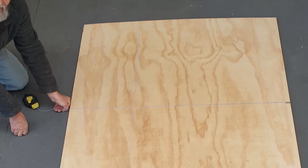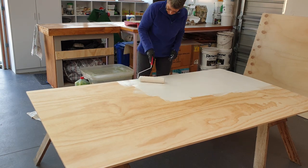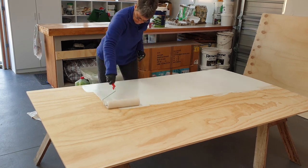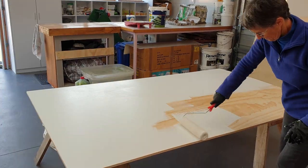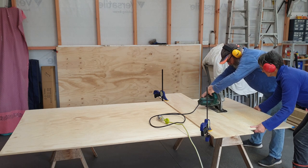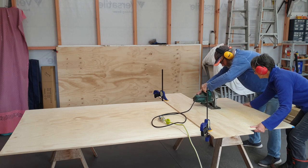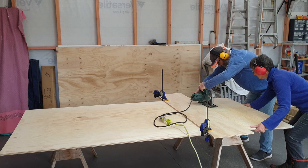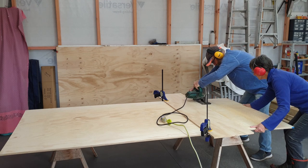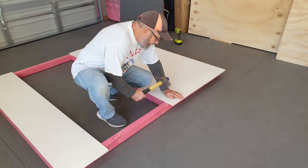The wall coverings are untreated 12mm plywood sheets. Since they're not treated, they need a good protective coating of paint on the edges as well as the sides. My last chicken house was also clad in untreated but painted plywood, and even after 15 years of winters, when a bit of rain came through one corner, the walls were still in perfectly serviceable condition. We cut the plywood sheet to the required sizes, and nailed it over the framing.